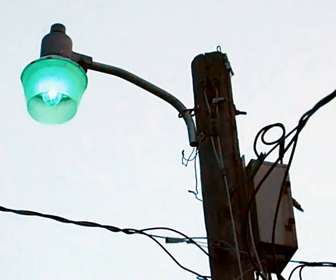If the discharge should be interrupted, e.g. by interruption of the electric supply, it is not possible for the lamp to re-strike until the bulb cools enough for the pressure to fall considerably. The reason for a prolonged period of time before the lamp restrikes is because the elevated pressure leads to a higher breakdown voltage of the gas inside, the voltage needed to start an arc (Paschen's law), which is outside the capabilities of the ballast.